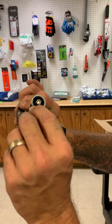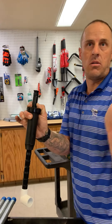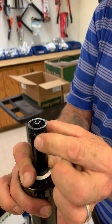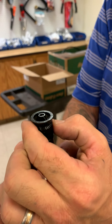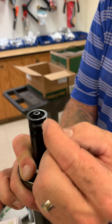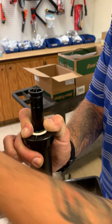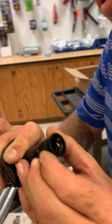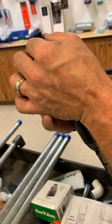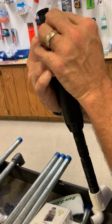Your filter goes in there and then your nozzle just screws on like that. Now you'll notice these nozzles have an L on them — you're going to want that L to be pointed down the left side of your grass at all times, because that's where that angle is going to start. So from right there, if you turn it all the way to the left it's all the way closed. As you open it up, the spray slowly goes from closed — the more you turn it to the right the more your pattern opens.